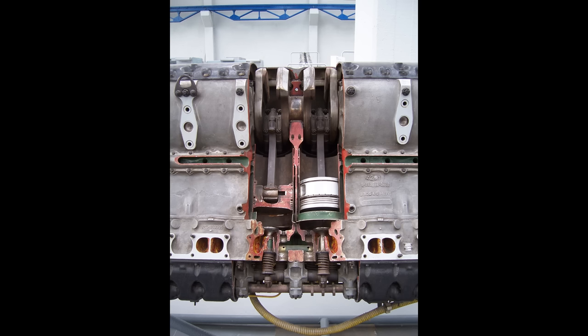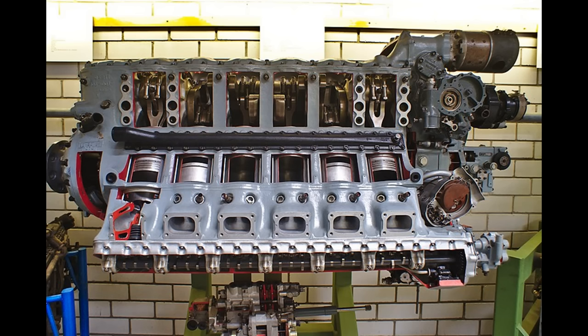The 213 did have some pluses. It was able to rev a bit higher than other engines, as high as 3,300 RPM. Most aircraft V12s of the day had RPM limits between 2,800 and 3,000, so that's a plus. And although this next point is very hard to quantify or even really back up, I do have the impression that the Jumo was a tougher engine than the DB605 used in late model 109s. In short, the Jumo 213 was a fine engine, but not stellar. Its main advantage over the Daimler-Benz engine was that it was available, and sometimes that's what really matters.